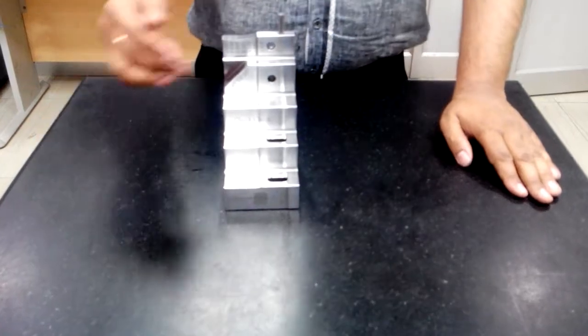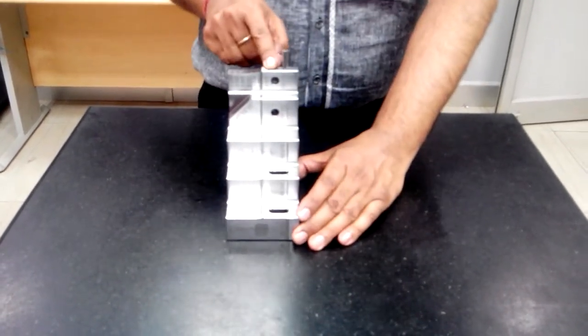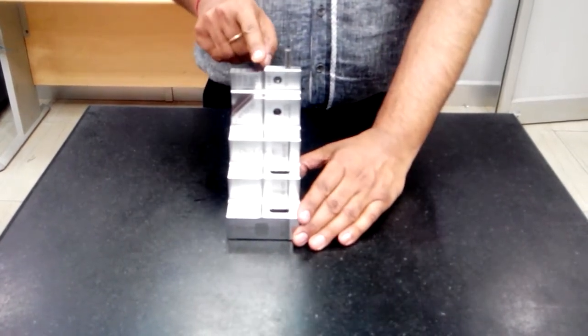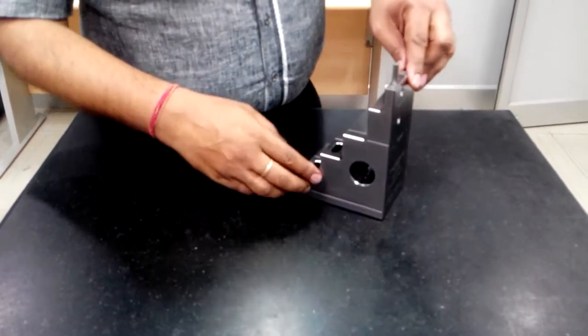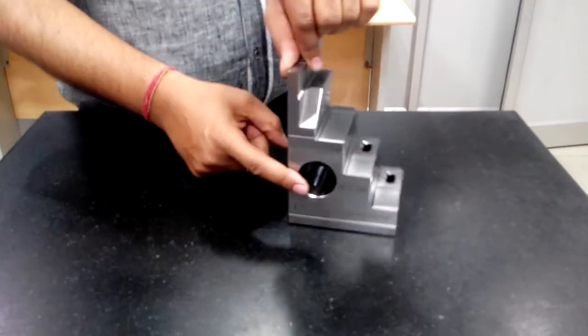With the macro steps, you can calibrate vernier calipers, micrometers, height gauges, depth gauges, and vernier depth gauges. With the small micron steps, you can calibrate lever-type dial indicators, plunger dials, and electronic probes.